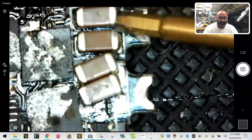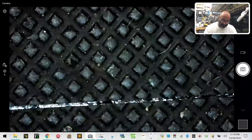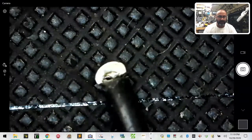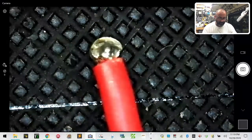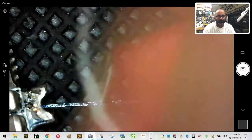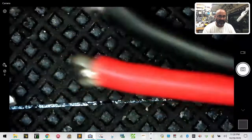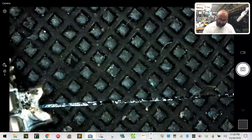Flipping it over — these have moved, but none of these smaller ones did. We see it more up here and then total chaos right here. The cable — I do not see any heat, any burns, any fire marks at all on here. What I see is a clear separation. Looking at how you solder to the ESC — you put the wire on here and it makes this little dot going through this small area. There's nothing here that tells me that it burned or caught fire. Could it have pulled off? Sure. Could it have been in an accident? Sure. But I don't have anything to show that — until I grab the capacitor.